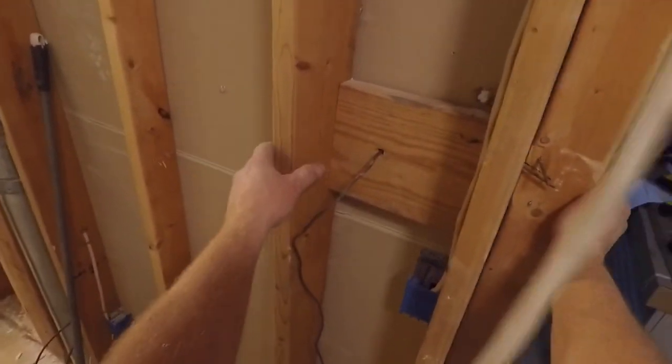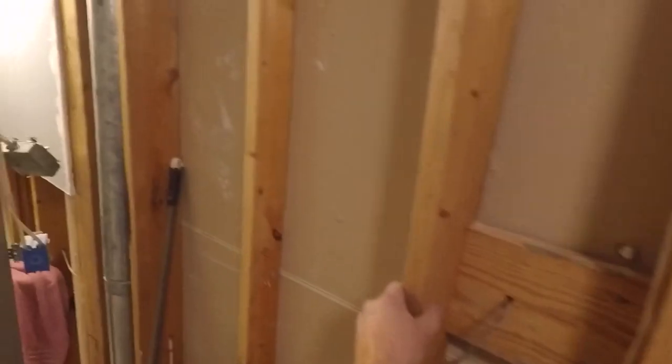So I've already removed and unwired the thermostat. Once I get this cut, I'm going to go around to the other side of the living room, and I should be able to push on this drywall from the back side, and it'll pop the drywall screws out, and hopefully this will come off in one nice piece. It looks like it's pushing away from the studs here. Go back around the living room side, and I'll pull out on the drywall, and it comes out just like a door. It swivels right on the corner bead, and then I can pull that out and remove that.